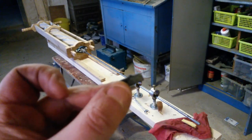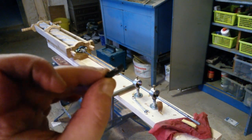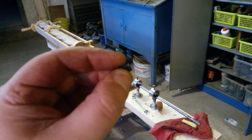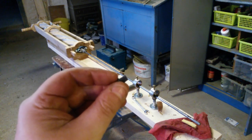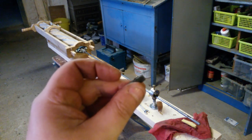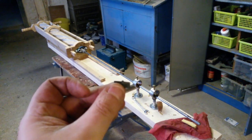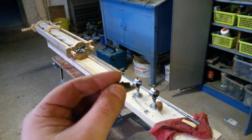The only thing that I'm not pretty happy about is that the cutting piece has too much wear. I think the reason is that the teeth are very high in angle. There's not so much supporting material behind the cutting edge, so there is a lot of wear. And I will make a new cutting piece where the backing angle is slightly longer.